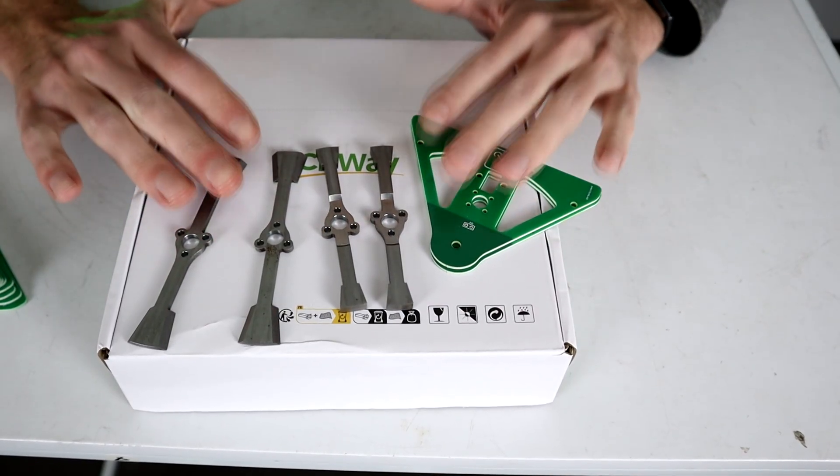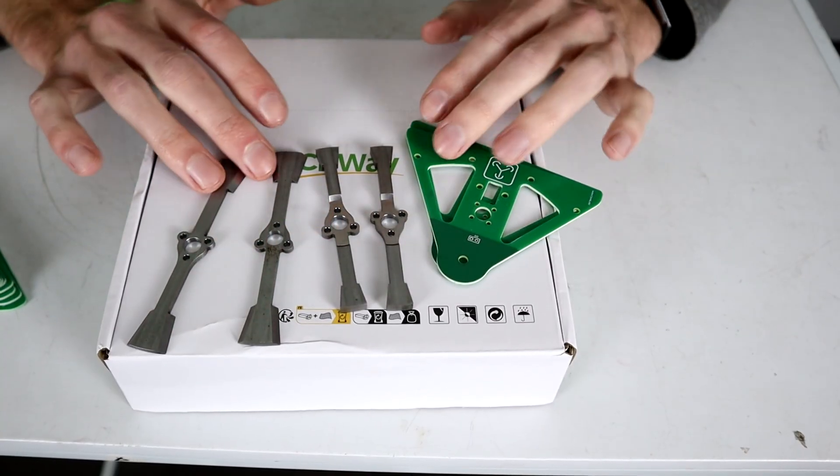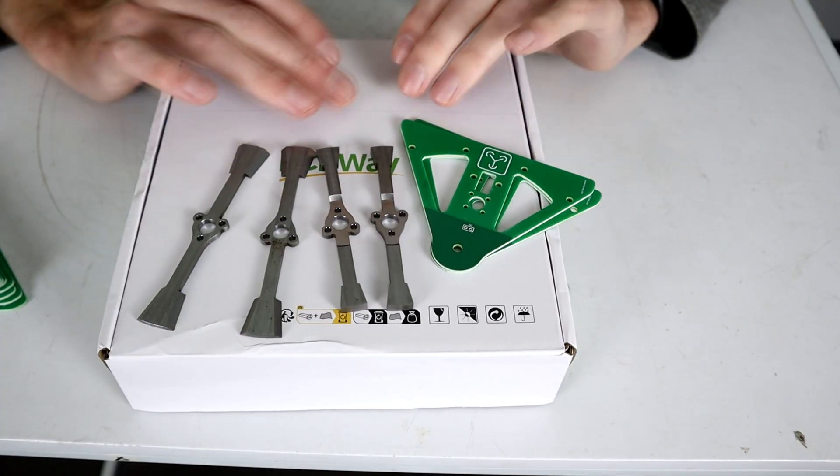These weapons all together are a little bit heavy, so the design of the robot has had to shrink in scale quite a lot. Speaking of the chassis — this is an Antweight with a 3D printed chassis, but I've done things slightly differently. Normally I'd use ABS because it's incredibly lightweight, but it's just not quite strong enough at this point. So I'm taking an 'if you can't beat them, join them' approach and going with a TPU chassis — but not regular 95A TPU. I've found 64D TPU, which is harder, so it should survive hits better and give more structure to the chassis.